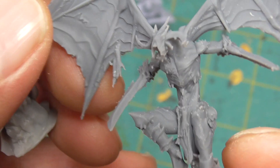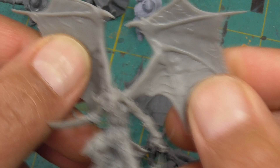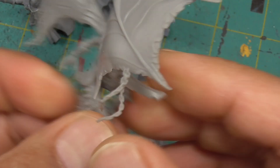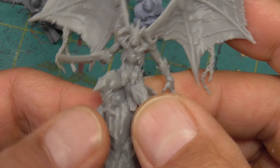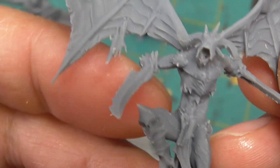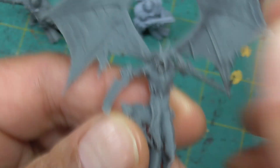Here we see the PAF-10 model, and the details are a little bit more crisp compared to the Sunlu mix. The reason I printed these Furies in the more flexible material was because I didn't want these delicate wings to break off. As you can see, there's flex to it — if you drop this thing, it's not going to snap off. With regular resin, even the chains underneath have a high risk of snapping off even as you're removing supports. For certain applications with really delicate parts like this, I do prefer more flexible resin. But you're typically giving up detail for flexibility — yet here, I have even greater flexibility and the details are still very crisp.